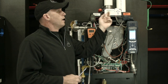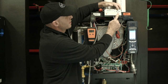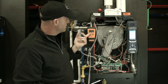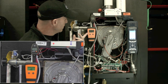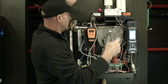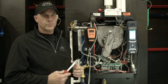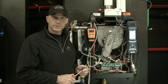To put this unit in service mode, it has a SIT control with a two-line, 40-character LCD. To access service mode, we're going to hold the Enter button and the up arrow at the same time. This initiates the fan and gets us set up to go through ignition. It does a pre-purge. I'm watching my pressure at 7.7 inches of water column, then running it through an ignition attempt — it's dropped down to about 7.3, so we're well within our ½-inch pressure drop. To check lockup pressure, I'll take it out of service mode while running and watch the regulator — it went right back to 7.7. On a new installation, you may want to do that a few times to make sure the lockup continues to stay within its range.